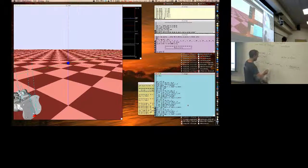So the desired velocity you could use here. In the current position, you would in this case actually use the desired position in x to push you over there. You would be tracking a desired trajectory in center of mass space, which gets you from your current location to the target location. So at some time, let's say 1 second, the desired position in x would be the same as the target where you want to go. Okay, then you have this, and then you just have to run this through a Jacobian. Jacobian inverse times x dot desired, and this will give you some joint angle theta dot. And then you would have to basically integrate theta dots to figure out what your joint positions are. Theta equals theta dot times dt plus theta old, essentially.